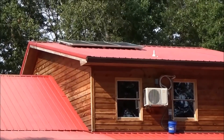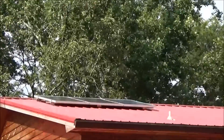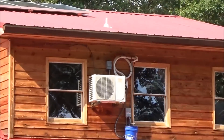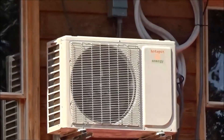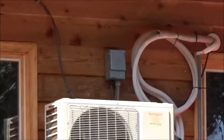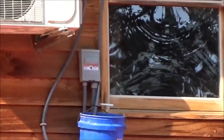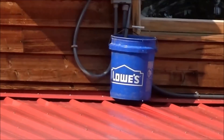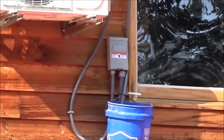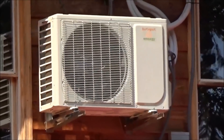As I'm thinking about how I want to cool my house in an off-grid fashion, I've gone with the mini split. I put three 300-watt solar panels on my roof and they're brought down to a disconnect. You can see the little fan turning in this outdoor unit. This is the combined AC-DC unit, so I'm bringing DC power from above and there's an AC disconnect there. I'm also collecting condensate — I'm getting about a gallon an hour of condensate water that I could filter to drink or flush commodes. It is producing a ton of water, and I love this so far.